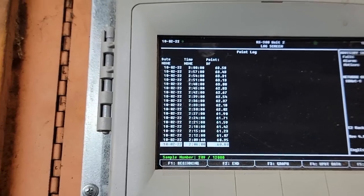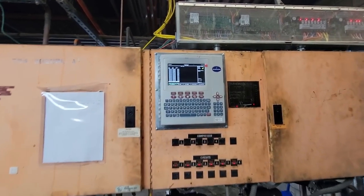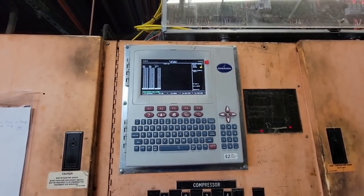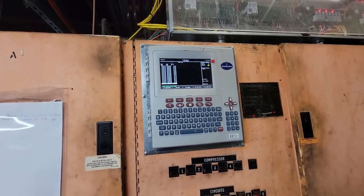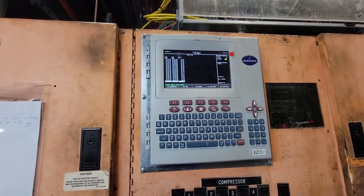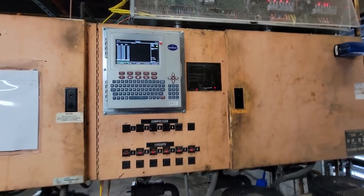Now, like I said last night, the manager said, hey, I already pulled the case, I just need you to shut the alarm off. Went ahead and set it to a higher value. He didn't have any food in there. I said, well, I'm only gonna set it so high, I only set it at 40. Normally it's at 20. And it ended up going higher and higher. Well, that's why I did it. So it triggered the alarm again, and that's when we knew something wasn't right.